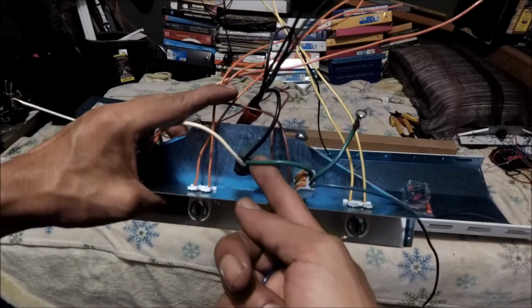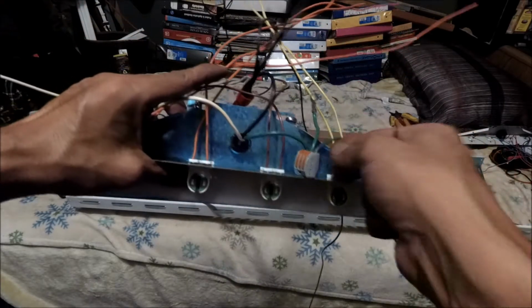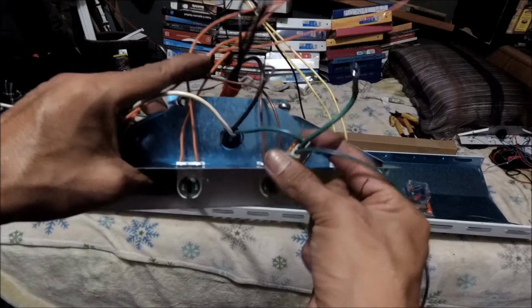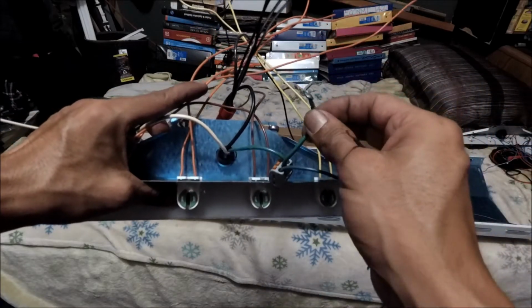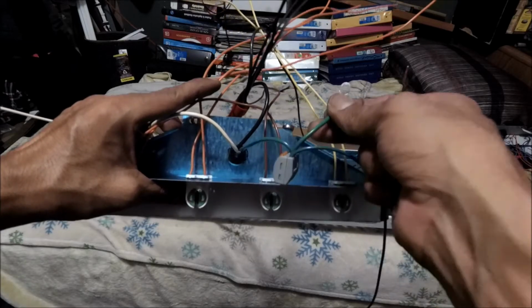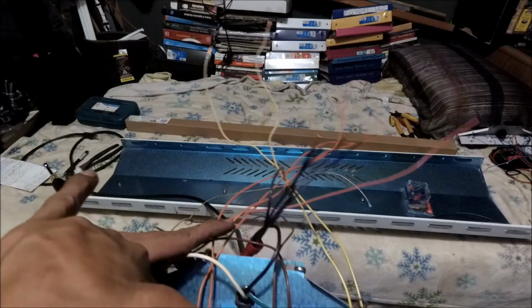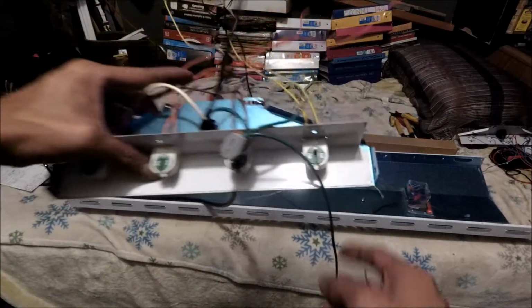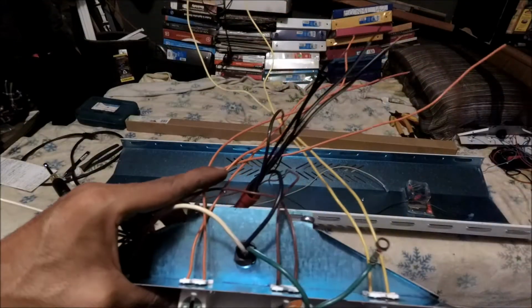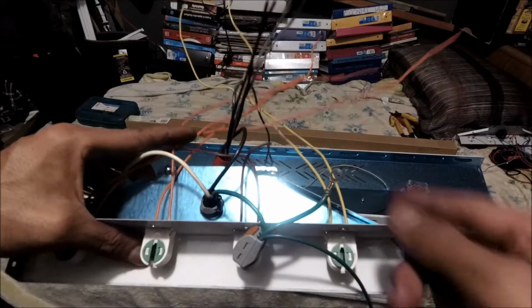And then the ground, the one that's mainly coming in from the cable, from the power cable, okay? And it has the original Wago that it came in. I did not touch this. The ground has to be grounded or bonded to the frame, the light fixture, to that nut right there. Remember, I detached this so I could move this around, or else it'll be stationary over there. So I made it mobile by removing it.